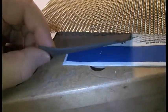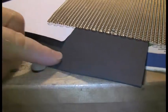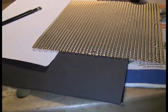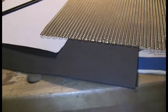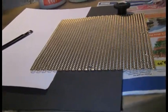To mount everything, by way of stopping vibration, I just found some of this felt material in the local art store, and I'm just going to cut that in strips like I did for the last one I did. Then I've got some of that spray contact adhesive, so I just spray it along one side, and then I'll stick it all around the opening so that the speaker grill and the glass plate mount against this soft material rather than butt up against the wood, and risk vibration and so on.